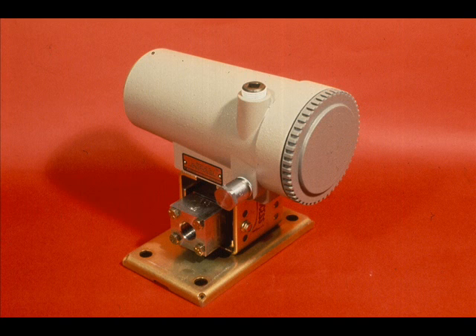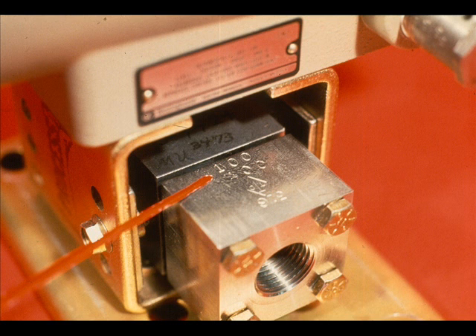We will change the range of this pressure transmitter to zero to 60 PSIG. Inspection of the measuring head shows that it is stamped 100, which tells us that we may calibrate from a minimum of 0 to 25 to a maximum of 0 to 100 PSIG. It is suitable for the 0 to 60 PSIG range.